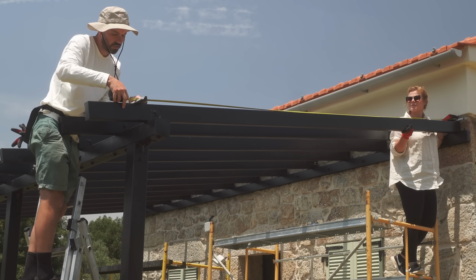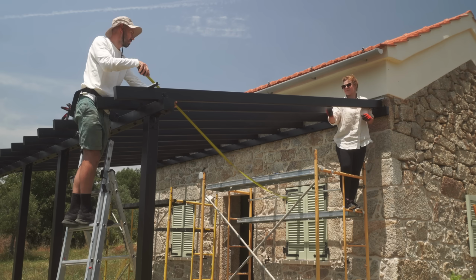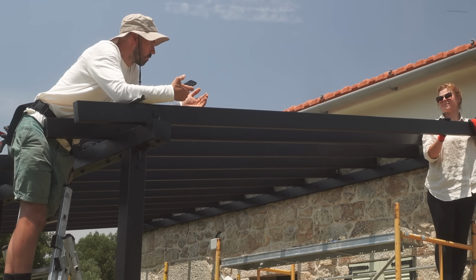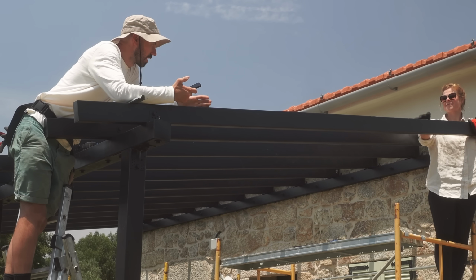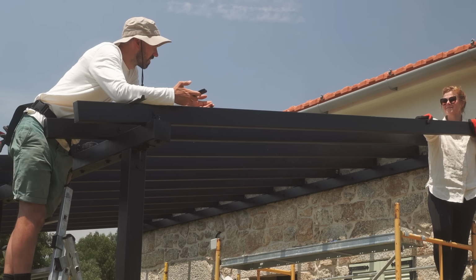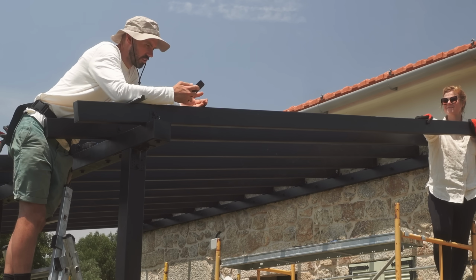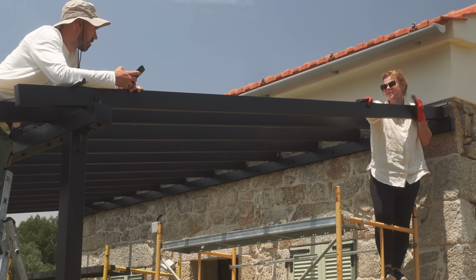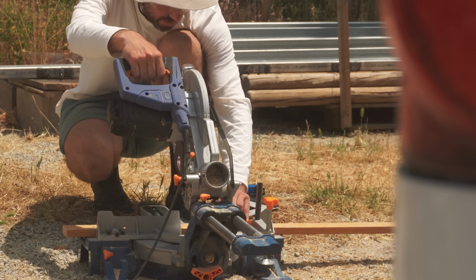3, 3, 6, 5. So, well, the permissible gauge is 35 to 39, with the optimal being 37. So 9 rows, 37.3. Perfect. And that's one less than we thought we might have had to do.